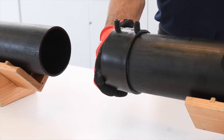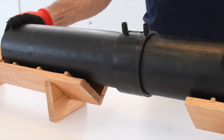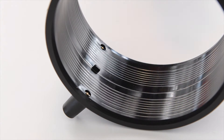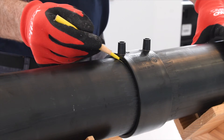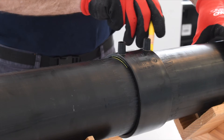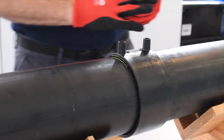Push pipe to the internal stop of the coupling. To remove the stoppers you will have to do so by shearing them out with the pipe if a slip coupling is required. Mark depth in case the joints move before welding. It is important that the pipe is all the way to the stops to cover the internal heating elements, otherwise they can be compromised.